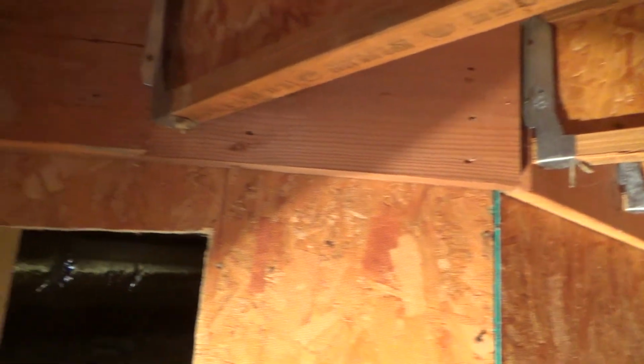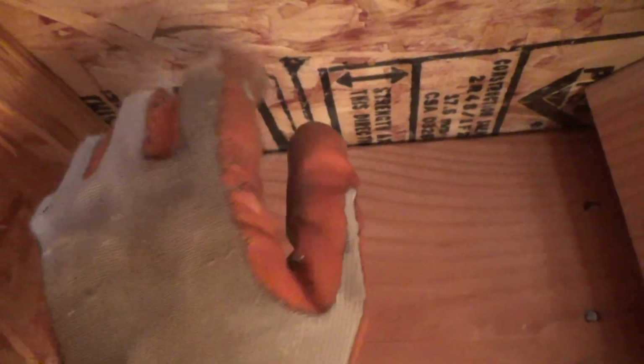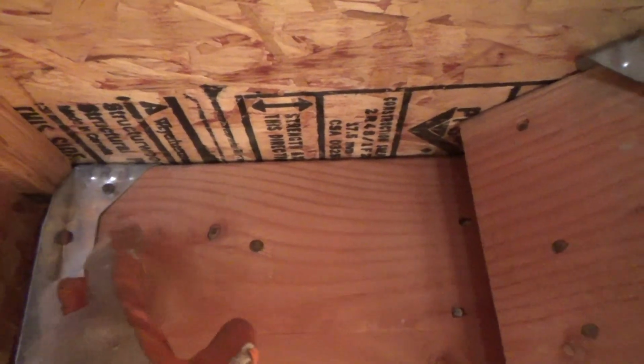But on this side, they used a band, a ledger, and then they have joist hangers. Their joist hangers are different than the ones that I put. These go up and they actually go back. There's a lip on there, maybe 1.5 inch, 2 inch lip, and that sets on top of this. So that takes some of the weight. And then there's one nail here and one nail there. That's it. Because most of the weight is up on top, and then a little bit of the weight is taken up with the joist hanger nails. So see, these are different than mine. Two nails, that's it. Nothing on the sides, because they couldn't put anything on the side, because you can see how they built those. That's what you call an I-beam. TJI, truss joist, I-beam, I think. I don't know, the name might be something else, but it's TJI.